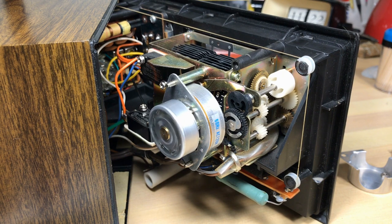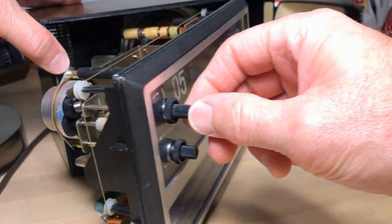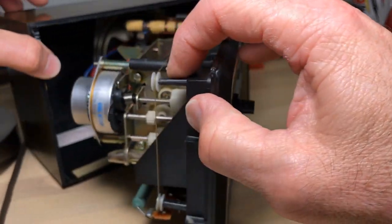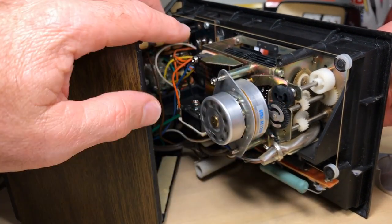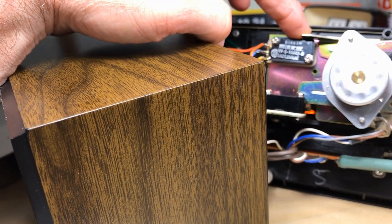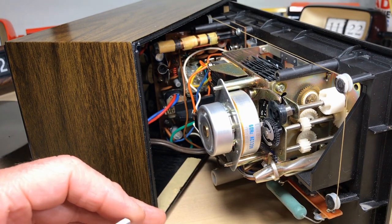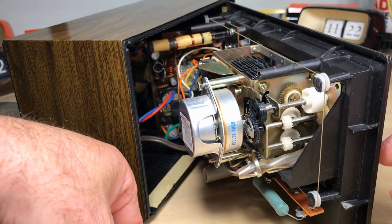Now that's what you want to have happen: when you plug it in, the motor comes on right away — and it does! For the younger crowd, the sleep function lets you turn the radio on and after a set amount of time it goes off based on the motor. The motor pushes a bar up which pushes a button on a micro switch which turns the radio on. Of course this radio only plays 70s music, which is awesome. That's how the sleep function works — I think it was just jammed a little bit. Here's the motor designation just for posterity's sake.